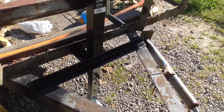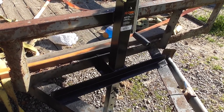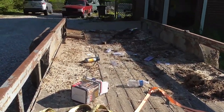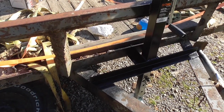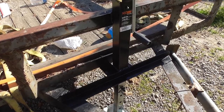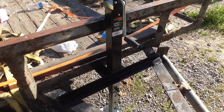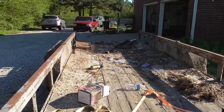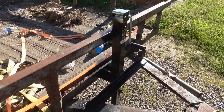The trailer and the rear end of the truck is actually somewhat supported on the jack — not fully off the ground, but the truck is lifted up a little bit. I was going to go to the back and weld some flat plate so I can hook the ramps on so they don't slide off when getting the Jeep up and down, but I think I'm done for the day — got a headache. Next I'll either weld that piece on the back and then do the wiring, or do the wiring first. That's it for the jack install — talk to y'all later.